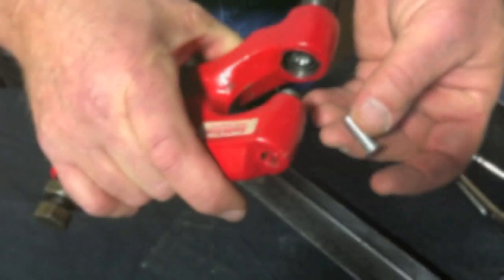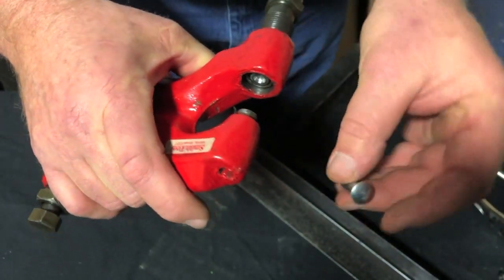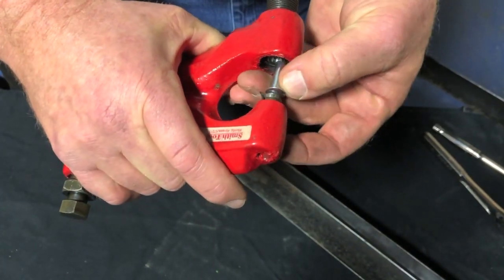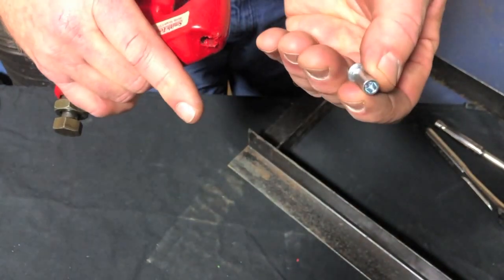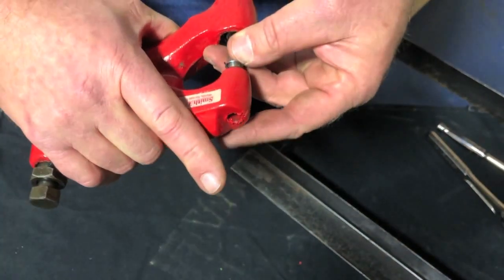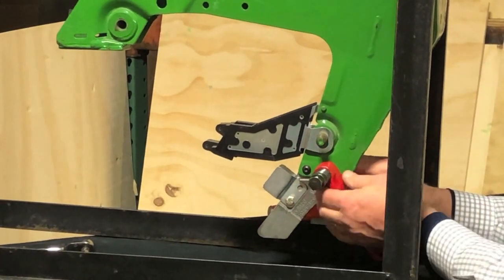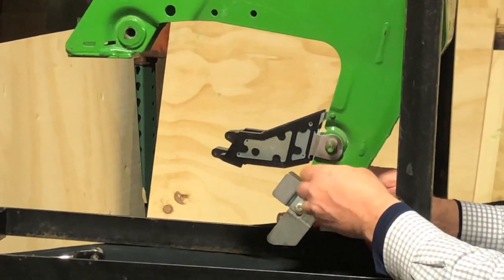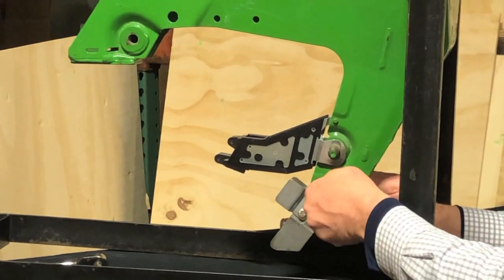Just to be clear on how to position the rivet tool with the rivet: we want to use the head of the rivet on the anvil of the rivet tool, so the swelling of the rivet is actually on the hollow end of the rivet. It is a very tricky tight fit, but once you have the rivet tool straddling the rivet, turn the outside flange part down first.